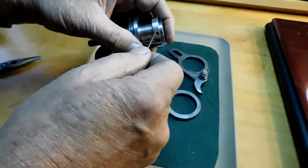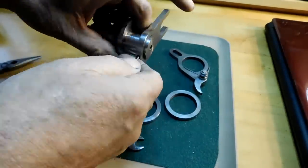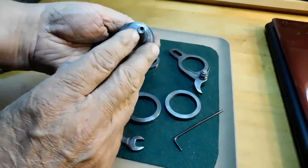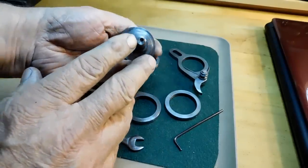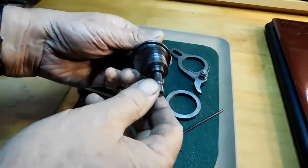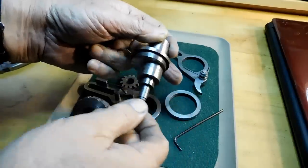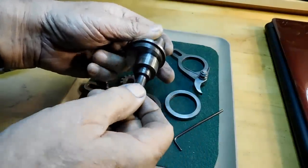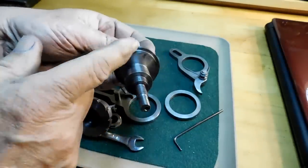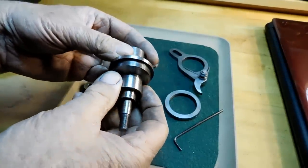And this piece just comes off with a set screw. This is what hooks it up to your faceplate to apply the drive to the unit. And this is in the front here. This is your first eccentric. It's off 30 thou, so it forces the cutter in 30 thou to cut the backside of your cutter blank. And this big eccentric in the back here, of course, was cut on a four-jaw chuck. It's much larger, but that is what allows the indexing to take place.